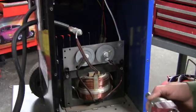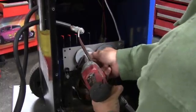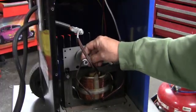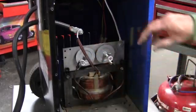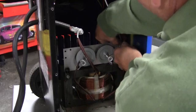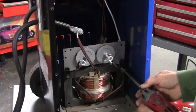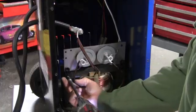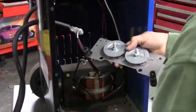So we're set up to take the rectifier plate out. First thing we're going to do is disconnect the transformer leads, which are two 7/16ths nuts. You can just pull those away — be careful, they're aluminum, so you don't want to break them. There's a couple of washers on here, you can take those off. Next we're going to take out the output leg from the plate, that's also a 7/16ths nut. We've got two 5/16ths studs that hold this plate onto the transformer. And it's that simple — we've got the rectifier plate out.